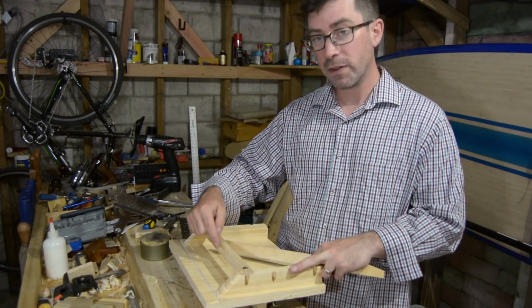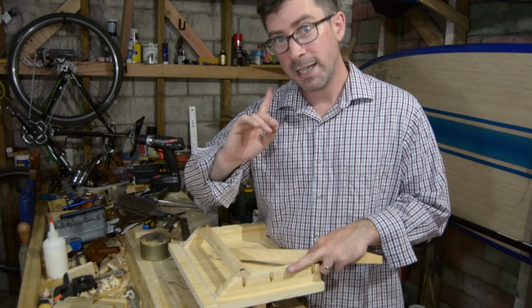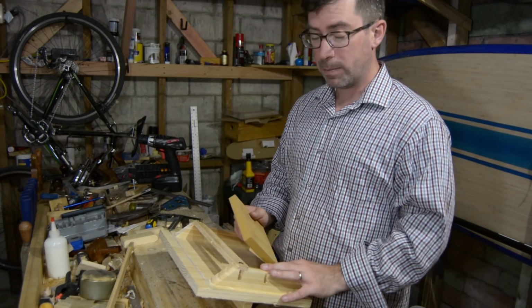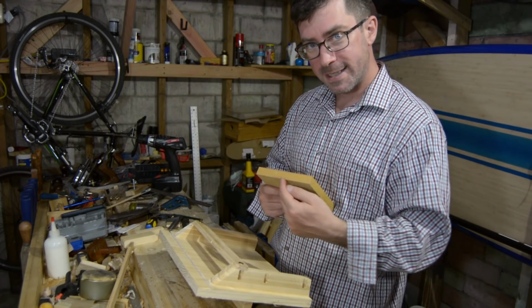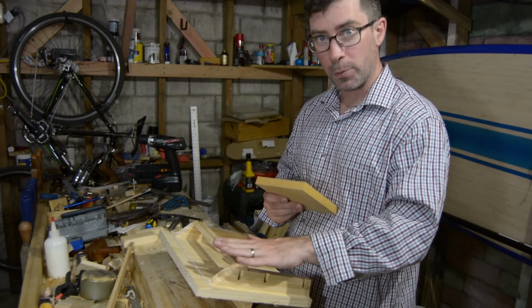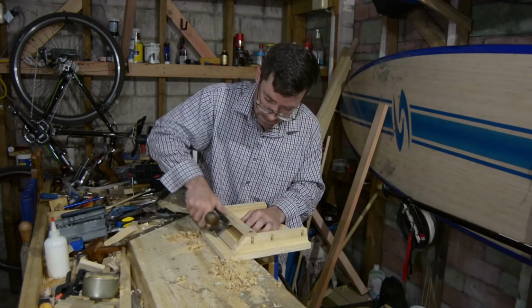There could be a little bit of a hump right here on the stretcher, which might throw it off a little bit in the center. I need to get some wider boards to test that. I hate planing MDF. Basically, if that last 16th is even all the way across, then I know that this is set up right. Or set up as right as I need it to be.